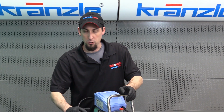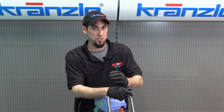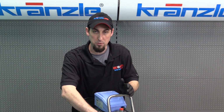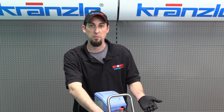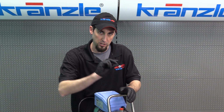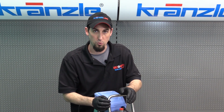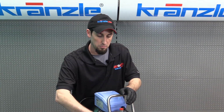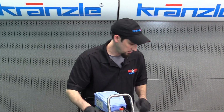So if you can turn it further and the pressure is no longer adjusting up, we want to back those nuts up so that the handle stops once we reach that maximum operating pressure. If perchance you're not up to the normal operating pressure, you may have to turn it clockwise a little further in. So that's the fine tuning that you would do on the jam nuts on the control piston. But as we're reusing the existing control piston, we already know that it's good.